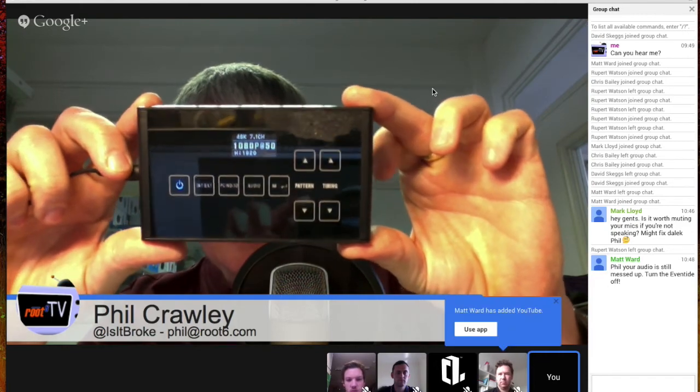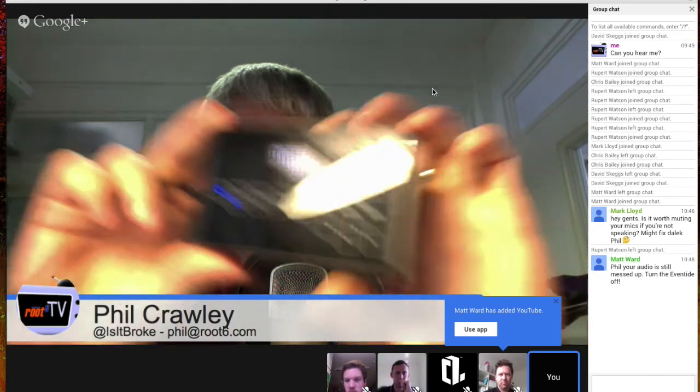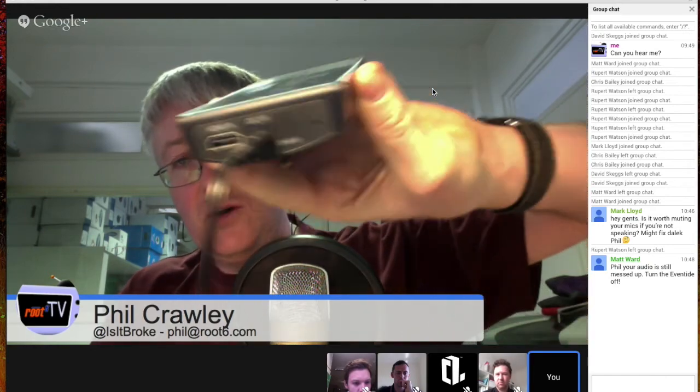I would mention a little gadget, which again Lindy do. It's a little thing you put in your toolbox, and it's a little kind of HDMI / DVI DisplayPort pattern generator that does lots of different standards. You see there, 1080p at 50. But it will also read EDIDs and display them. So it kind of goes in line with your monitor. You can see there's HDMI in, and HDMI out. And it goes in line with your monitor.